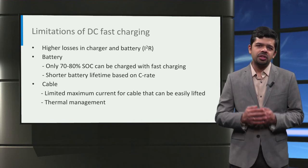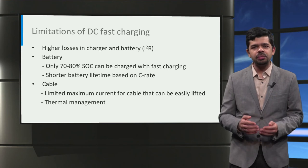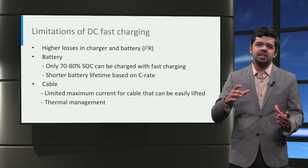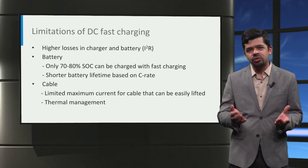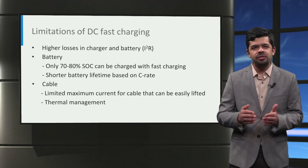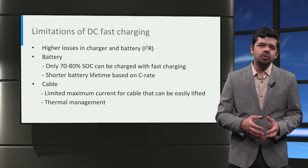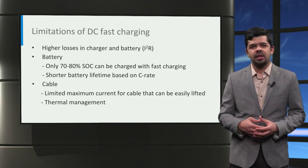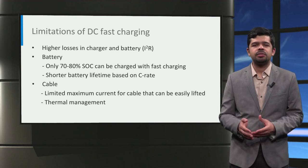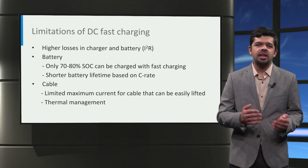The third limitation is coming from the charging cable. For any EV charger, it is important that the cable is flexible and lightweight so that people can carry the cable and connect it to the car. With higher charging powers, thicker and thicker cables are needed to allow more charging current, else the cable will heat up due to losses. DC fast charging systems today can already transmit charging currents up to 250 amps without cooling. However, in the future with currents above 250 amps, the charging cables would become too heavy and less flexible for usage. The solution would be to use thinner cables with cooling systems and thermal management built in to ensure the cables don't heat up, which is of course more complex and costly.